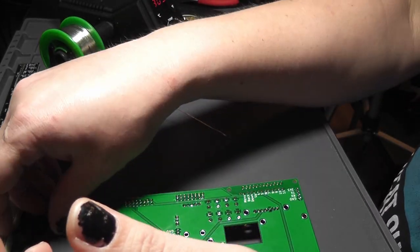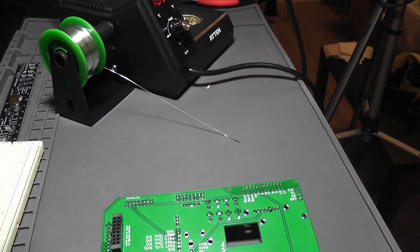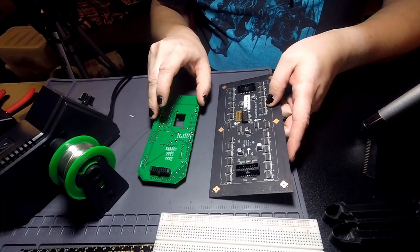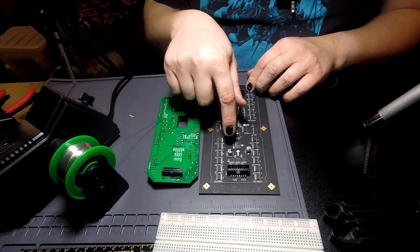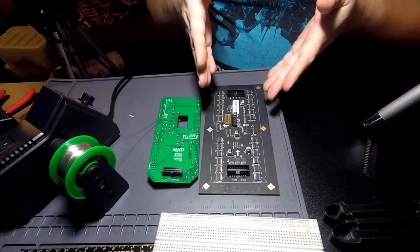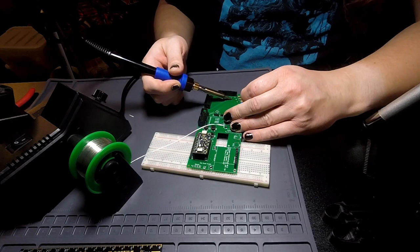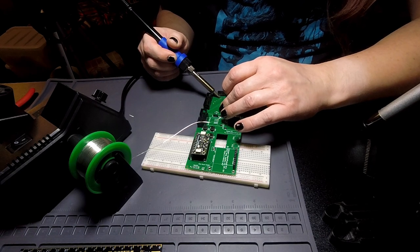That means the only thing to do is on this side, put this connector on, and I need to validate exactly which direction that needs to be for the keying, just to make sure I don't get it wrong. And this is the correct direction for the keying. The key is up here because the notch is up here. This is the input because there's the plus on this, and obviously this board goes in this orientation on here. So that is the correct orientation for that. And then when I'm done with this, I do still need to bodge wire the microphone.